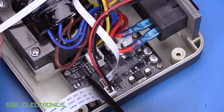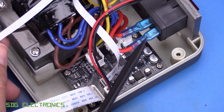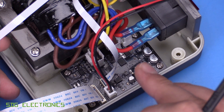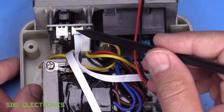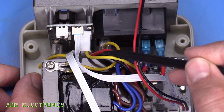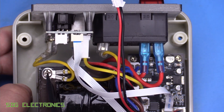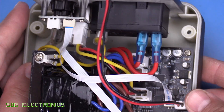There's a little instrumentation amplifier for thermocouple measurement providing an analog output to the microcontroller. The main connector to the front panel handles USB, thermocouple output, MOSFET control, current sense, and the cradle detection for handpiece sleep and tip removal. This is very similar to the GVM, just a little simpler and lower cost. The IEC connector and power switch feed two AC connections straight to the transformer, with an earth connection crimped onto the transformer and the 4mm banana jack — everything looks quite good from a mains safety perspective.